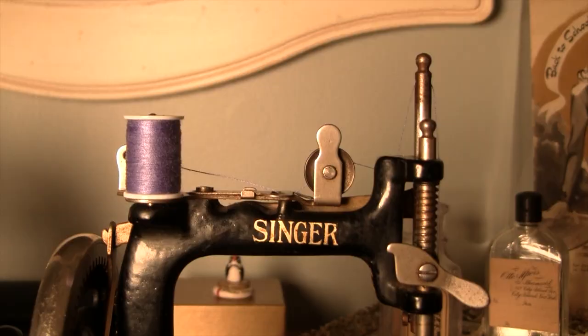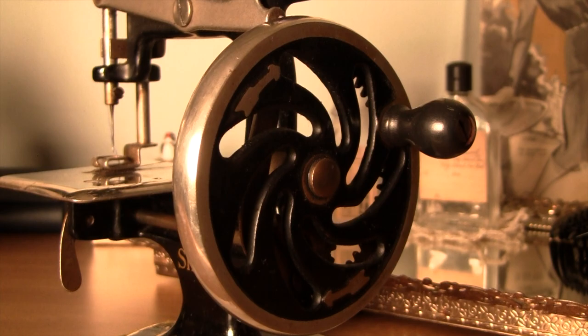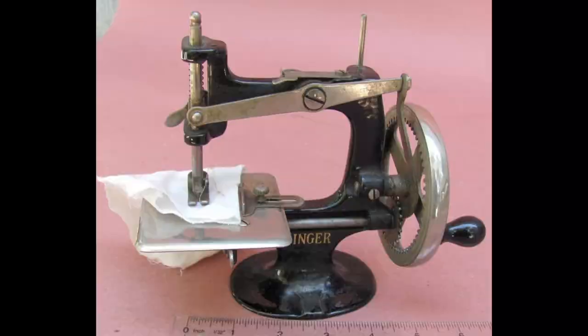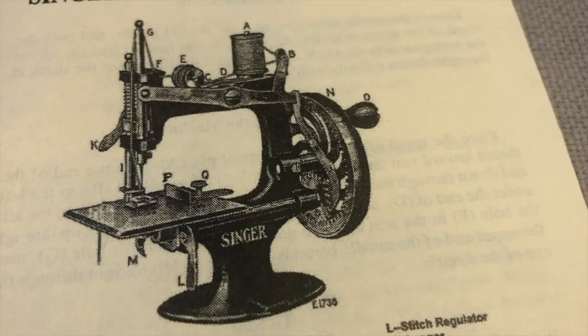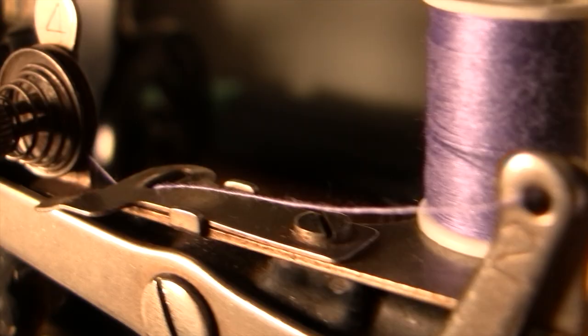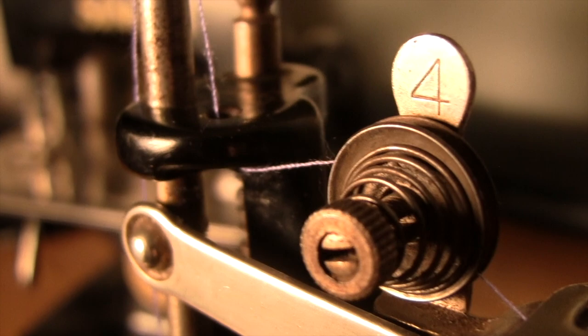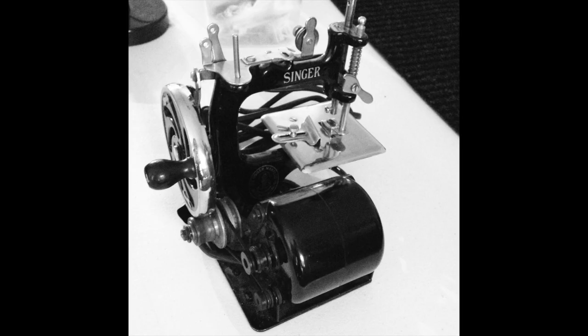The model I'm showing right now is the one manufactured from 1926 up until the 50s, but there were several variations between 1910 and 1926, which can help you date your machine. From 1910 to 1914, the handwheels had four spokes and no threading eyelets or tension disc, similar to some variations of the Model 24. Then from 1914 to 1922, the handwheel was changed to eight spokes, more similar in design to the 1926 version. They also added threading eyelets, but it wasn't until 1922 that the machine was stamped with numbers indicating the order in which to thread it. They also made an electric version called the Singer 22, spelled 20-2, though I wasn't able to find too much information online about that.